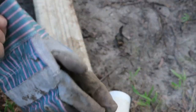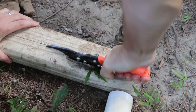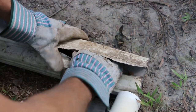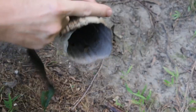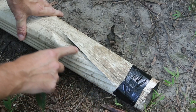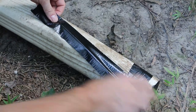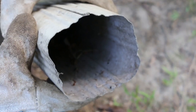This aluminum is pretty sharp so I'm going to put on some gloves to do the forming part. Once I've got this reduced down I'm going to strap it with some duct tape. I'm also going to put some duct tape along this seam to prevent air from escaping. With my gloves back on I'm going to round the shape of the end of the downspout so it is a better match for the shape of the fan.